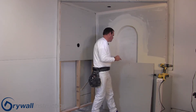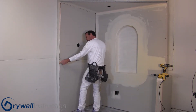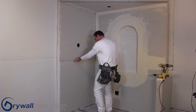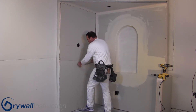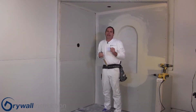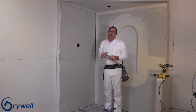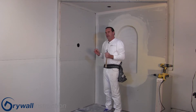Let's go ahead and hang a piece of sheetrock here and show you how it's done — the different methods we use in fastening sheetrock. I'm going to use a drywall kick that I talked about in the hanging section before and we'll get this sheetrock right up tight, then go ahead and sink the nail. In the picture I'm showing you, you can see what it looks like when a nail has been sunk properly. There's a dimple, but the nail hasn't been sunk too far to where it actually broke the paper around the nail.